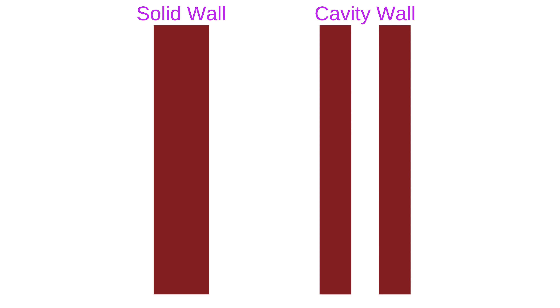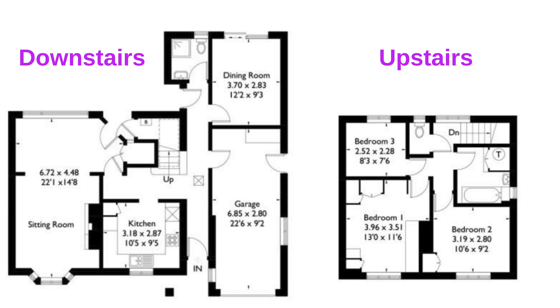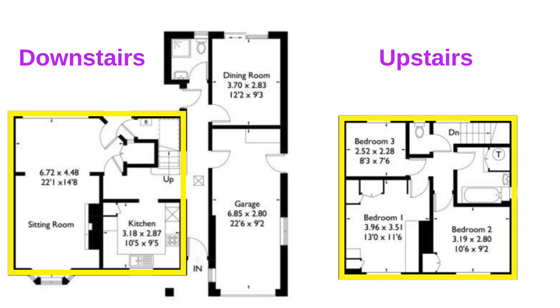Okay, we're ready — so why am I doing this? There are two main types of masonry walls: a solid wall made up of two rows of bricks, and a cavity wall which has the two rows separated by a gap. If my history's right, the 1930s are when cavity walls became mainstream. The 1920s were a mixed bag of solid and cavity walls, and this house was completed in 1926 and unfortunately missed the boat, having the same solid brick walls the Victorians were so fond of.